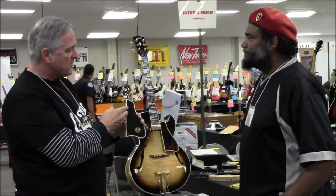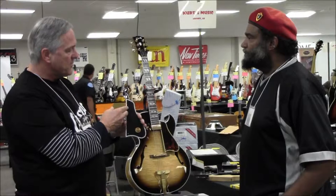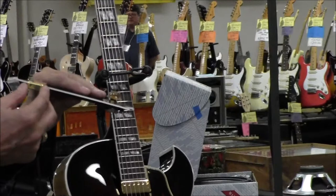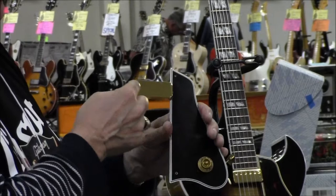This type of pickup is called a mini humbucker. You can see it's not a full large-size humbucker pickup — it's a mini. It is double coil and it is noise canceling, so it's a quiet pickup. The thing that my model has is individual pole pieces to give you a little more volume on individual strings. In addition, you get thumbwheel controls which are hidden, and it gives you a smooth guard — you get rid of the tone control.